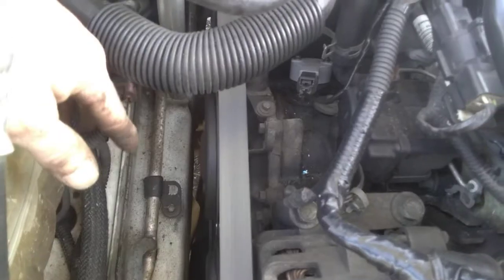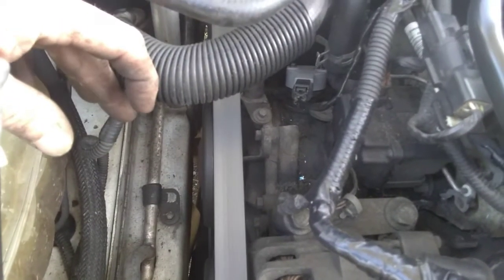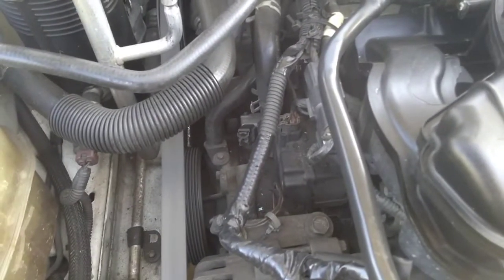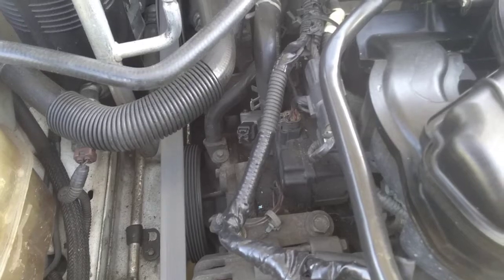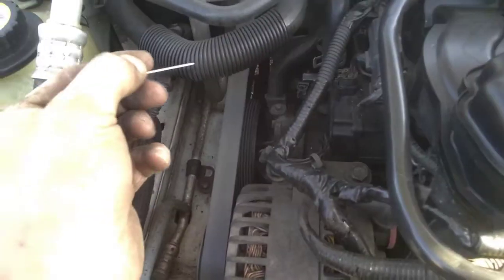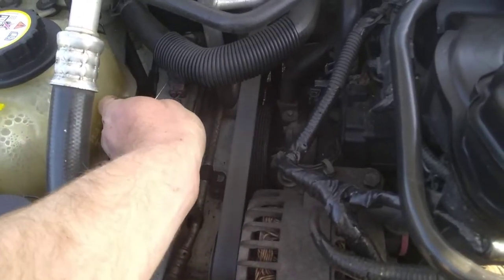If this switch goes bad, it can cut open, which is what it's doing here. I don't have my service gauges with me today to show you, but this air conditioning system is running fine — the refrigerant charge is good, there are no restrictions, and there's no reason it should be going out on low pressure.